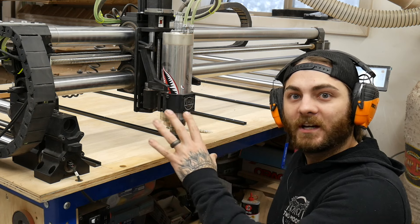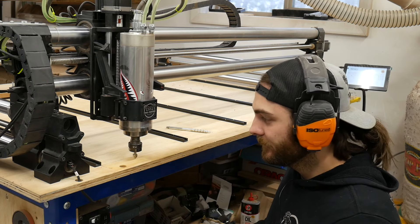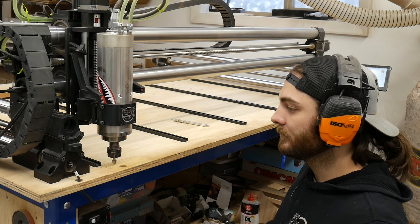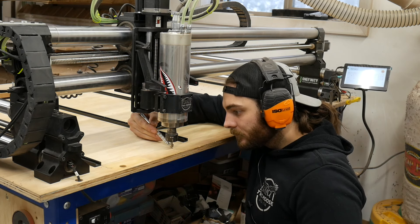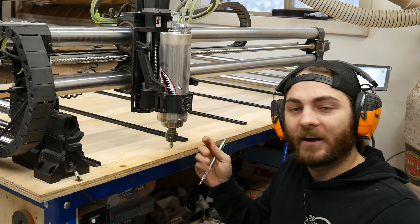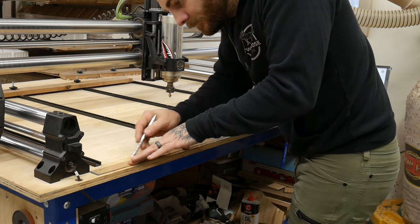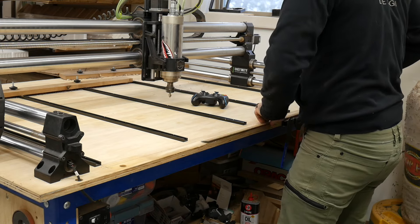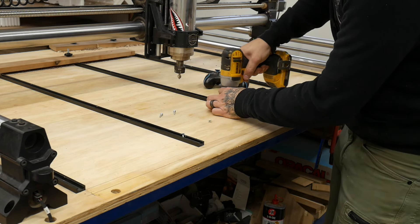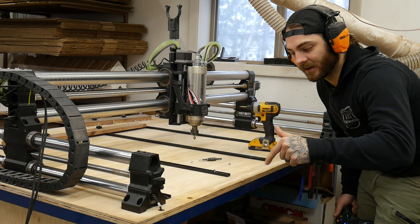Now I'm going to figure out the actual cut area of the machine. I just have a regular V-bit on here — nothing special, just anything with a point — and I'm just going to mark that roughly, doesn't have to be perfect. I'll do that all the way around and make a square to show my actual cut area and how far the spindle can actually go. I already have the back three segments marked since I'm just replacing my wasteboard and changing the front. But if yours is brand new, I would mark all four sides. I do have a more in-depth video on all this, so I'll add that link up in the corner and in the description.